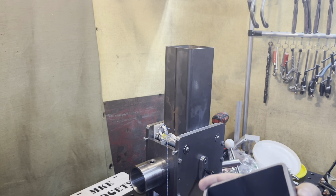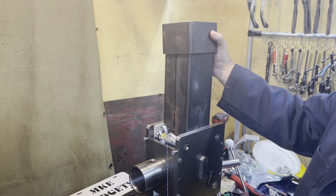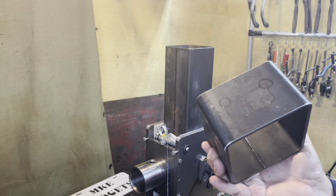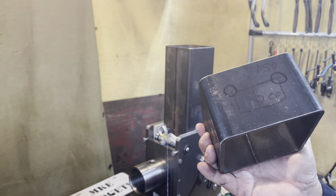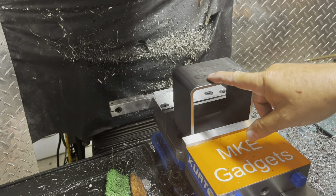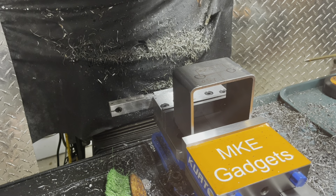So what we're going to do first: two half-inch holes here and two half-inch holes in here so this can be bolted on. The best way to drill holes in something like this — you guessed it — the Bridgeport mill. Two half-inch holes: center drill, then drill. Time to make the chips.